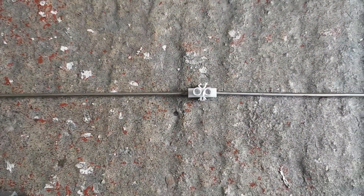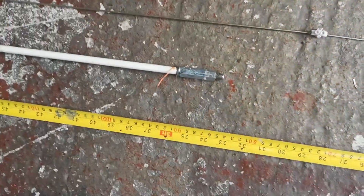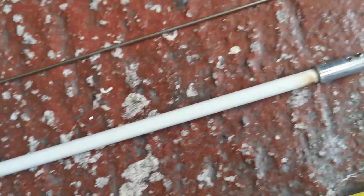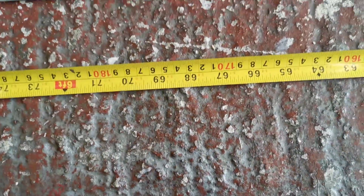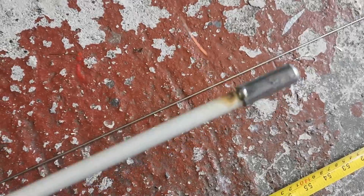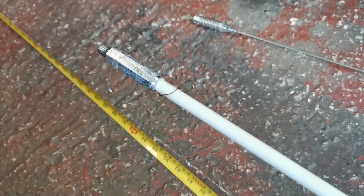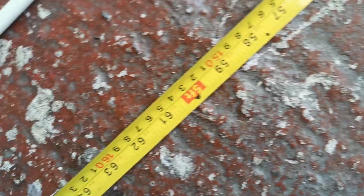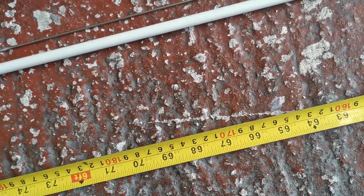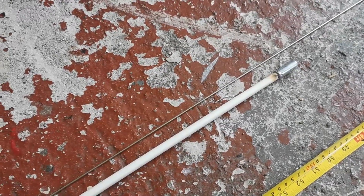Okay, so I have it stripped down now. Took all the enamel wire off and there's a temporary join here — I'll come up with a neater solution. The beauty of this is that where the whip goes down into the fiberglass part it's hollow all the way down, so it's going to make tuning it very easy. I left a little piece of enamel wire on each end, removed the enamel and have them tinned. So I'm going to run a length of it up along and temporarily tape it, then put the whip in, stick it on a base and see what happens.